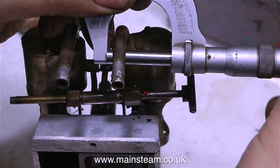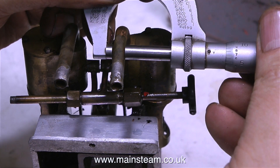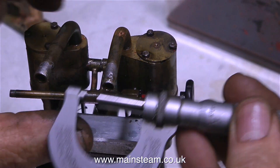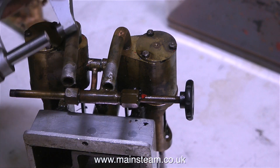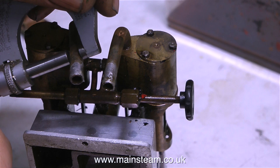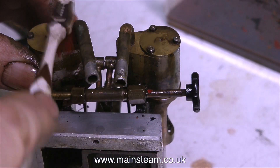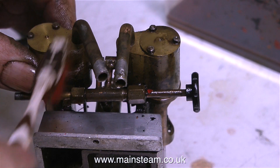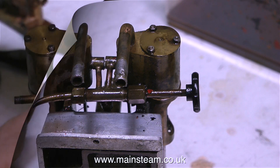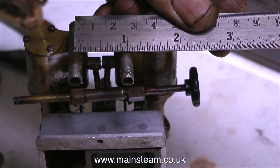Originally these exhaust pipes faced downwards into a collector that went underneath the baseboard. I'm not going to do that — I'm going to make a new collector. I thought this was quarter-inch piping but no, it's actually slightly thicker. What I propose to do is make an exhaust collector and re-solder these pieces of pipe into the collector, and then the combined exhaust from the collector can be piped up the chimney. I'm just giving the engine a final wipe over with the toothbrush to make sure there's no bits of paint sticking to it. With the pipe set to the correct position I'm measuring the distance between the centres of them and it's one inch.